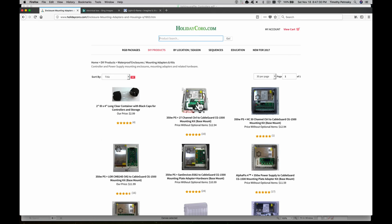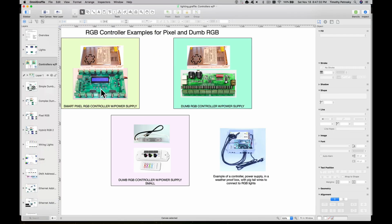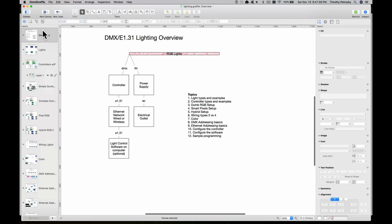Last thing I'll finish with is these controller boards do have this little chip on them, and I don't know if you can see this chip I'm circling right here. This has got 4 of them. And these are like $2 or $4 each. If you get some weird electrical thing, it can mess these up. So it's always good to order a couple extra of these so that if you have a problem, you can use a plastic tweezer or something and pull that out and put a new one in, and it just works. We'll cover in our next video, we're going to go through the dumb versus smart RGBs.